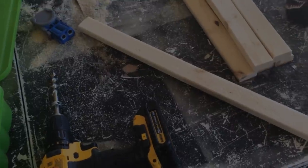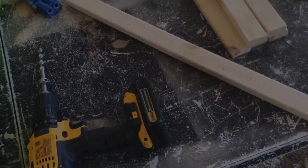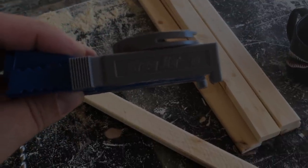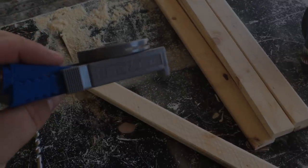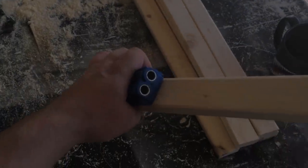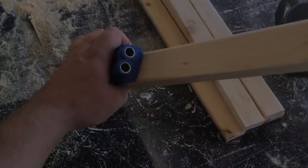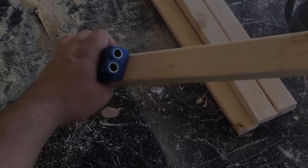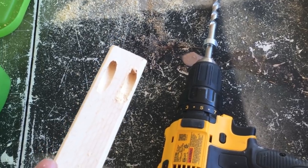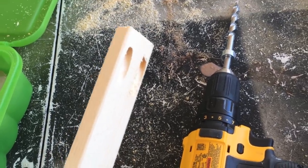So I'm ready to make the egg trays — this is also going to be the floor of the cage. It's going to have half-inch hardware cloth underneath it. Putting these together is real simple. I have here a Kreg jig — it's a pocket hole jig. All it does is allows me to drill pocket holes. You line it up at the end, use the drill bit supplied with it, drill down and it makes two pocket holes, which means the screws are hidden and it doesn't split your wood. It's very, very clean — means I don't have screws sticking out inside the cage, everything's recessed.